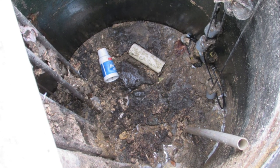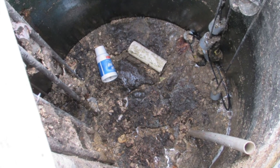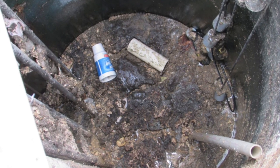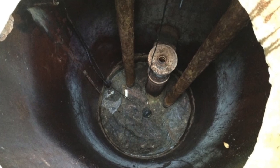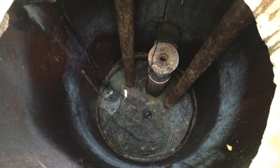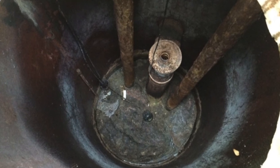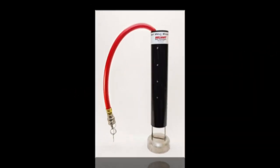Thin grease caps will form slowly in areas with less homes or eating establishments, but as these concentrations increase, the grease caps will become thicker, often getting in excess of 3 feet thick. It is not uncommon for grease caps to form around float-level switches, and because of the cap's weight, actually pull the float right off of its cable. With the Wet Well Wizard, all of these grease cap experiences can be a thing of the past.